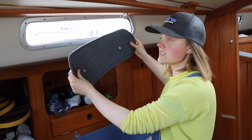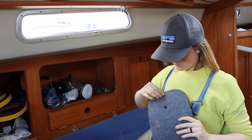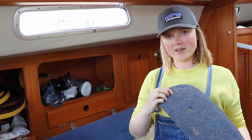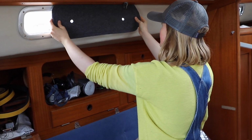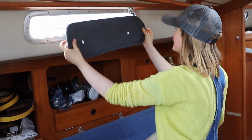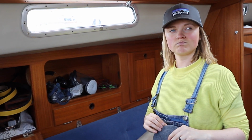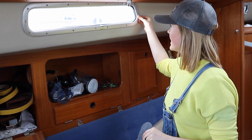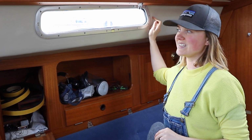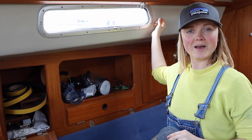When it comes to my blinds that need the exterior magnet attached to them, because this is not magnetic, I'm going to be putting a little dot of paint onto the exterior magnet and then holding it up to the frame. Obviously this is not the blind for this window. And then just touching it onto the frame so that I'll then get a little mark. From there I'll be using epoxy Gorilla glue to stick my magnet onto the frame to avoid having to screw into the frame or use sticky snaps that might come off. That's how the blinds will attach to non-magnetic surfaces.